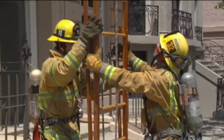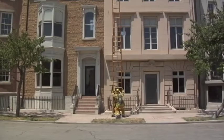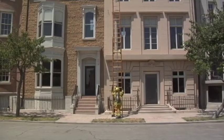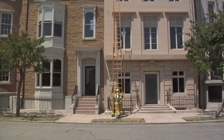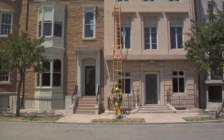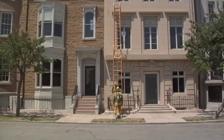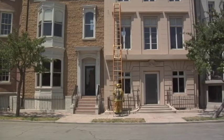The ladder is now ready to lower into the building. The base member will state, "lower in," and brace with one foot forward and one foot back. The tip member places one foot on the center of the bottom rung and the other foot back in a brace position. Lower the ladder into the objective slowly, maintaining control. Check the climbing angle. The ladder is ready to climb.